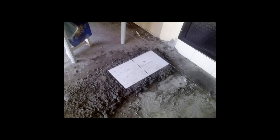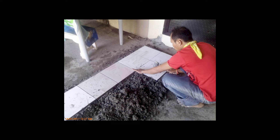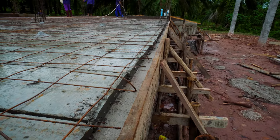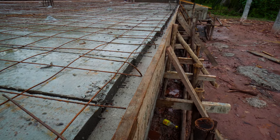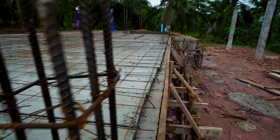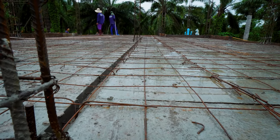They can get this semi-flat, but it's funny in Thailand — it's all pretty much left to the guys that do the tile work. You can see the small rebar right there that's embedded in the grade beam. It's now bent over and incorporated in with the wire mesh to tie everything together real nice. Double ones here in the center going each way. Like the way they tied the wire together here — that way it's not going to shift around on them.